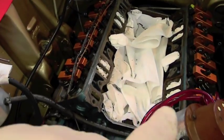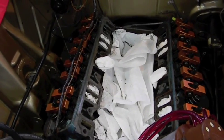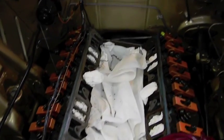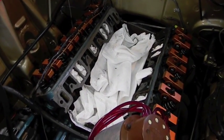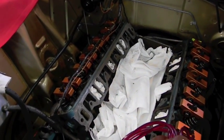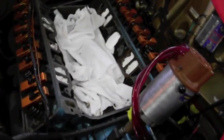Yeah, we're getting there. Clean the front, the back, and I'm cleaning the side. I'm gonna get out the vacuum, get what's falling in there for now. Man, the motor's dirty again. Gotta get everything. All you need is a little piece of that stuff to hold the gasket up, and you're done. There you go. I cleaned all the surfaces with a razor blade. Okay. Vacuumed it. Then I hit it with 220, and re-vacuumed it. So that's its first cleaning. So the front and back will be hit with 220 too. Now we move on to this side.